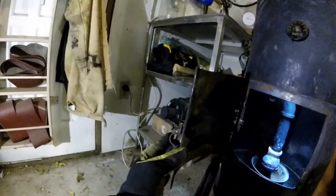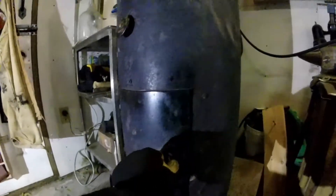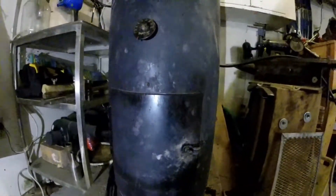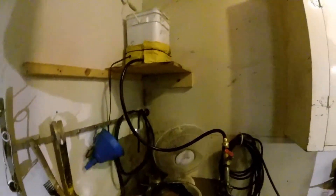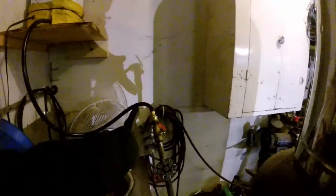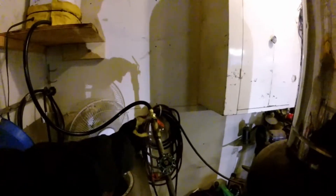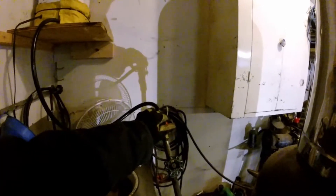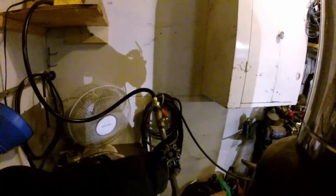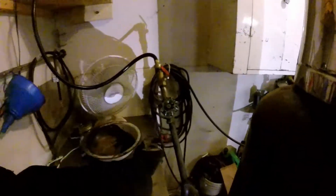The handle is some conduit clamps just bolted through, which allows it to clamp on. As I've shown in other videos, we're just using a bucket full of oil. It's tubed out, siliconed around, goes down a hose with a ball valve fitting into this fitting. This opens and closes to allow zero or full fuel. This one here regulates how much oil actually flows through it.